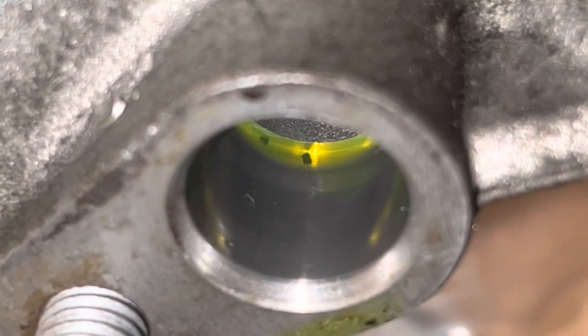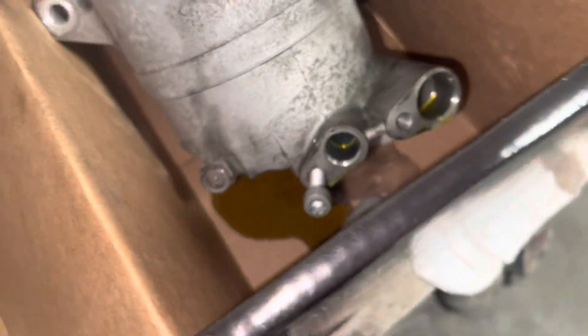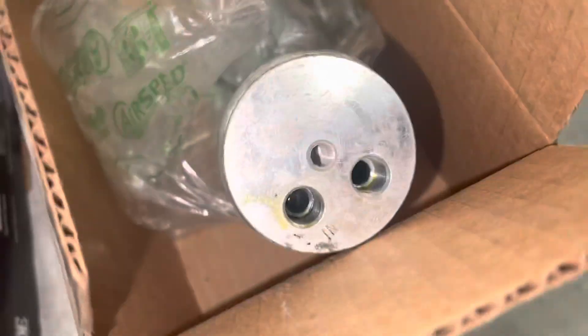That's a little black — you see how dark that is? That gray color, more of a silver color inside — see down in there? That one has gray because it started to overheat. No particles, but it did start to overheat and run hot by being low on refrigerant. He says it was making a little noise — that was probably because of lack of oil and very low refrigerant. But he could replace the compressor, so that's good. He replaced the receiver dryer too — that's good.